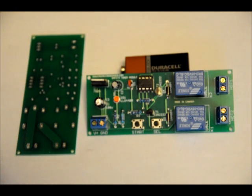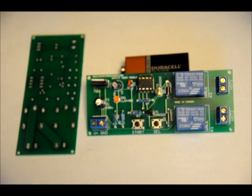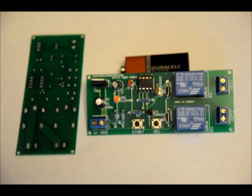And I've got a poorly modified extension cord that I'm going to connect here, and then I'm going to connect my soldering iron to that extension cord, and it will apply 120 volts AC to my 30 watt iron for 30 minutes as we go. So again, start applies power, the power relay turns on and takes over for the power switch, and then I can turn it off at any time by pressing select.